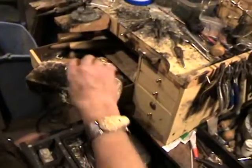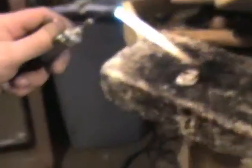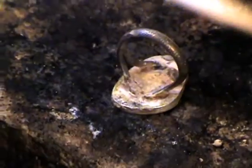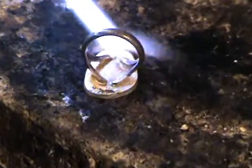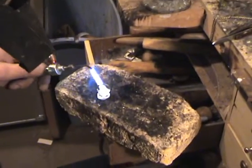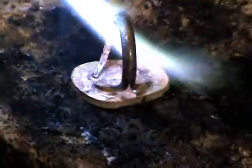This is called a fast cleaning. This will clean off all the flux. If you're just making one piece and want it to go fast, this is how you do it. Just keep your flame on and watch the flux — it's going to bubble up and turn a white crusty color. Don't make it melt like glass, just leave it in the bubble state. The acid will eat most of it away — see how clean that is now? If you do it slow enough, the heat and water will boil all that stuff up and bring it to the surface and take it completely away. Then get the piece a little warm — looking for the metal to start turning colors, turning gray or brown. See it turn right there.